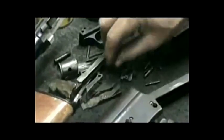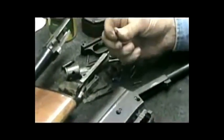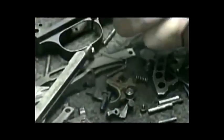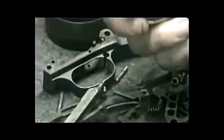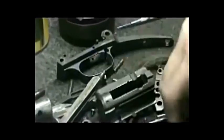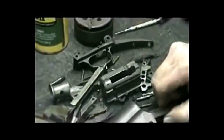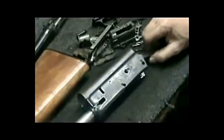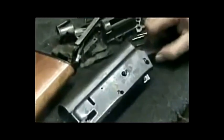During the disassembly process is when we do a lot of our inspection for worn parts. I didn't really see much in this gun. It's got a lot of badly burred screws — lock screws especially — that I might have to replace. We'll polish them the best we can, but if we can't clean up the burrs we'll replace those screws so it looks right. Then we're going to go over to the glass bead machine and sandblast this rust off so we can get an idea of what kind of pitting we have in the metal — all that pitting has to be polished out.